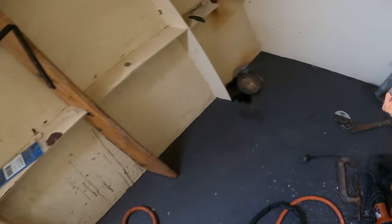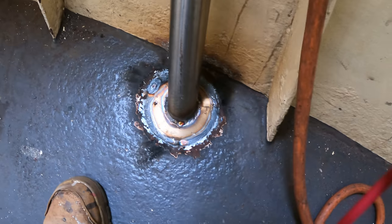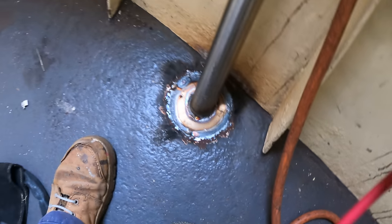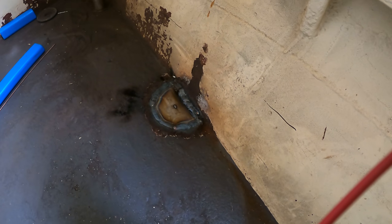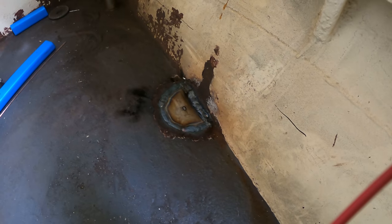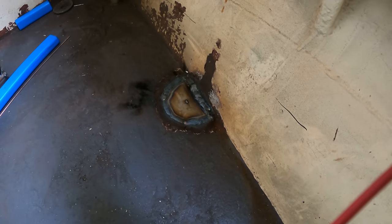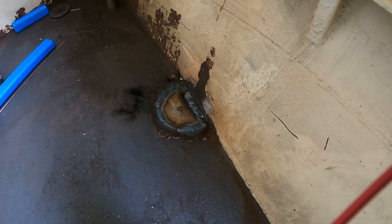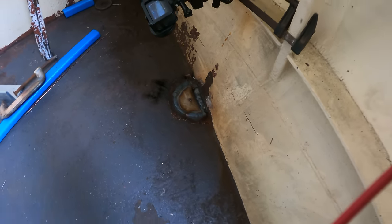Right, those guys are welded in. Come up pretty clean, I'm happy with that. That one there is pretty fine. It's all good. That one there was a bit of a breakfast, actually. The steel around the back was rustier than I thought it was going to be. So every time I hit a bit of steel, the puddle would always turn to a bit of mush. So I needed to clean it up. So yeah, there was a wee bit of cleanup to do on that guy. But all up, she's in, it's done.